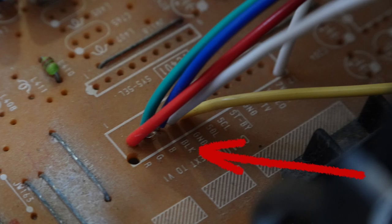We know our blanking is right and our RGB is right, now terminated with 75 ohm resistors rather than whatever combination you might end up with if you hadn't checked the existing resistor values. Now we need to look at sync — and sync is the easiest one because you don't need to do anything. For these particular CRTs, I use composite sync. I don't have to add separate terminals for composite sync because this TV already has composite. All I do is plug my sync straight into the AV1 composite input and my sync is taken care of.